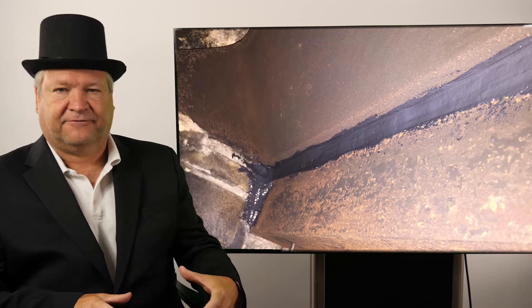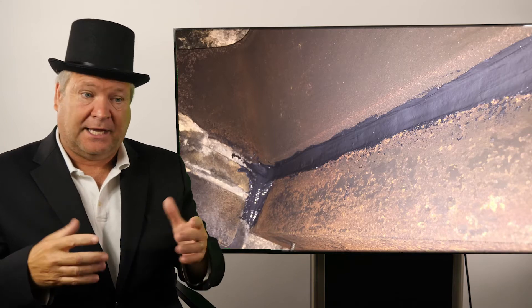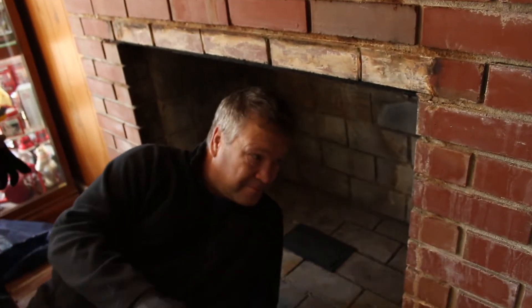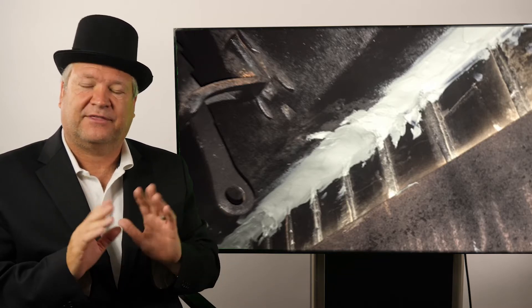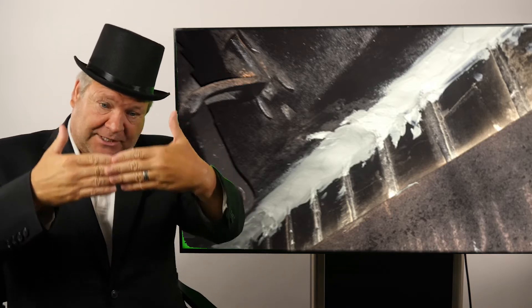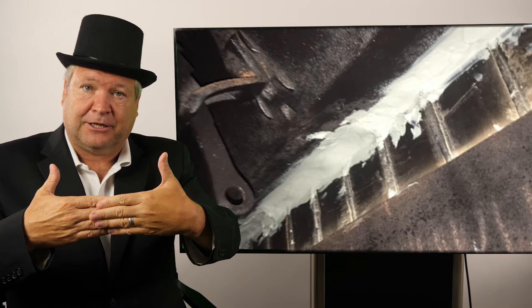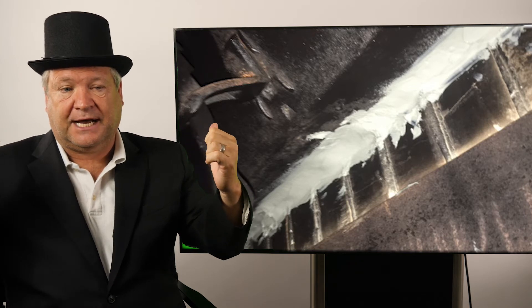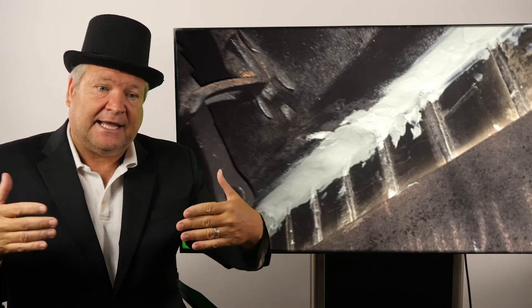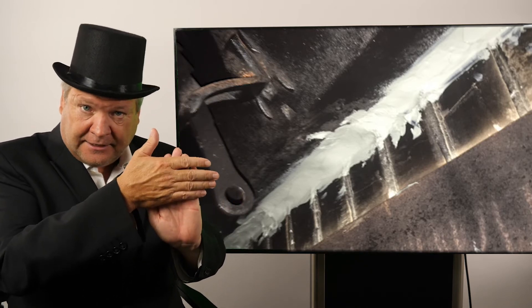You've got a chimney that's being built. It's got the full chimney structure. Now, if you have a chimney that's on its own foundation, it's been required by codes that says the chimney can only hold its own self and nothing else. You put a face over top of that chimney and that is what is in the front of your fireplace — that is your fireplace opening. That brickwork goes around your chimney and it also ties to your exterior framing and exterior studs, and it has a thing called a collar joint that goes in between your chimney and your front brick facing.